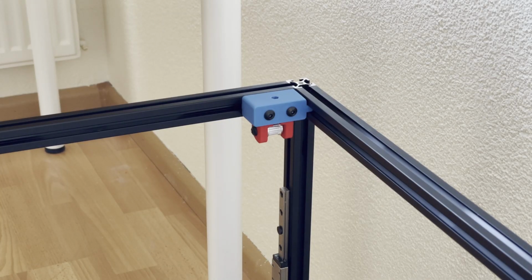That was all for the Z parts. We assembled and put them in place, on the frames, and obviously our Z drives and Z idlers. And in the next one, I will prepare the bed, but I will not be installing it because, especially while we do the wiring, we need to turn around these frames a lot, so of course it will add weight, etc. So it will become harder if we install the bed now. So I will just prepare it, and after wiring is finished, I guess I will install it in its place. That was all, like I said, and see you in the next one.